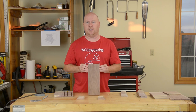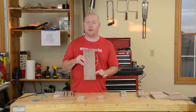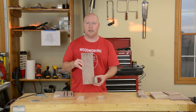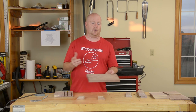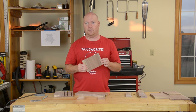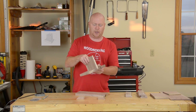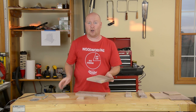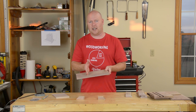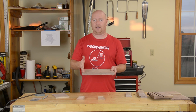After this piece is ripped to the correct width — which turned out to be 4.5 plus a 32nd — the next step is to cut the dados that go in here to hold all of the shelves. The very first dado is the top of the box, and I've used my rail pieces to make a mark for where it's going to be. My shelf material isn't exactly 3/8 — it's a little on the fat side, so I had to dig out the shims for the dado set to get a slip fit on the shelves. I'm going to cut one dado, mark from the top of that, cut the next one, mark from the top of that. I left this board long so everything will work out even by trimming it after all the dados are cut.